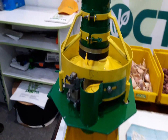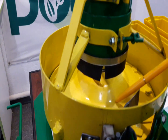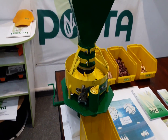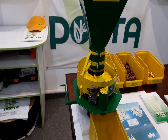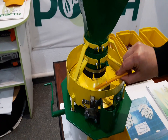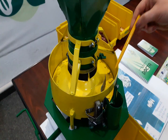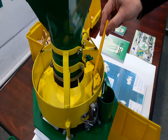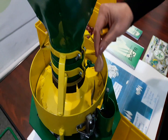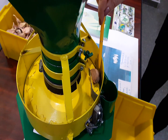As well as the clearance size between the flexible tube and the distributive cone. The setting adjustments of the sowing unit should be done before planting. The clearance size between the flexible tube and the distributive cone is set in accordance with the sowing material size. The clearance between the leveler and outer cylinder is also set in accordance with the sowing material size.